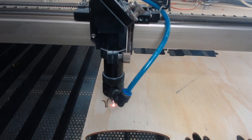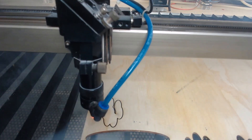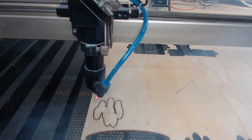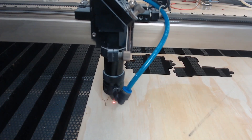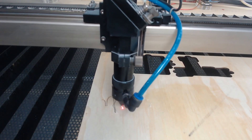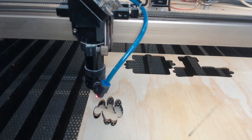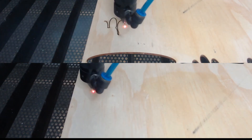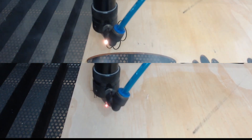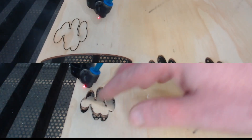This first cut I'm doing out of three millimetre ply board using just the regular air pump that came with the laser machine. As we can see there's a little bit of residue around the edges of the cut. For this next cut I'm connecting up the air compressor and I've dialed the air pressure to 30 psi. The focus gap, speed and power are identical to the previous cut. You can see already that the cut is a lot cleaner and more crisp. Placing the two cuts side by side — the top is the regular air pump, the bottom is the air compressor — you'll notice that the smoke from the air pump circulates to the top of the workpiece rather than toward the extraction, whereas the high pressure from the air compressor forces the air lower into the machine toward the extraction unit.